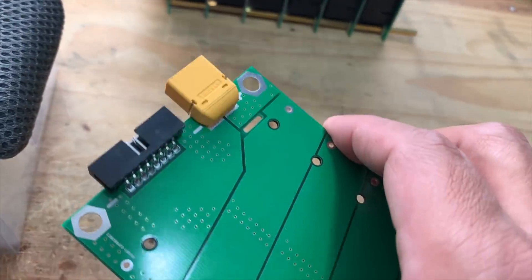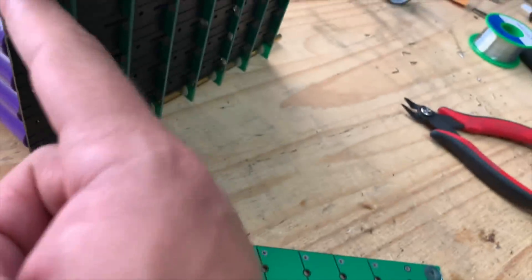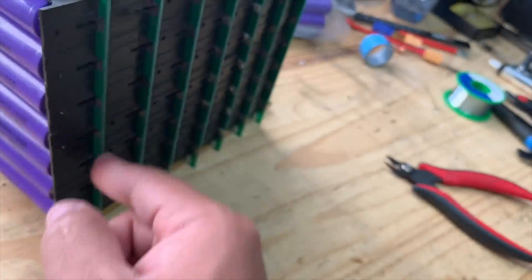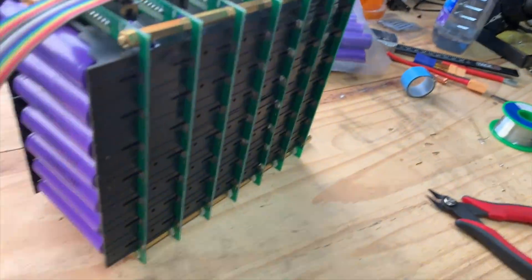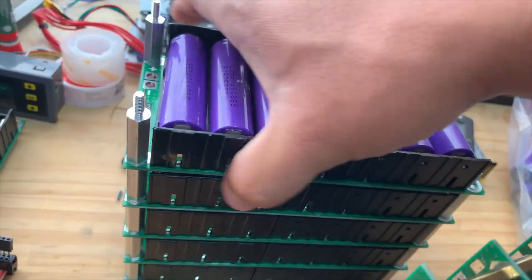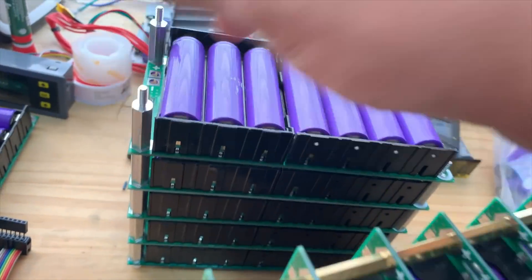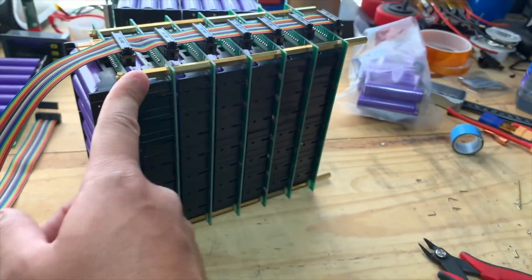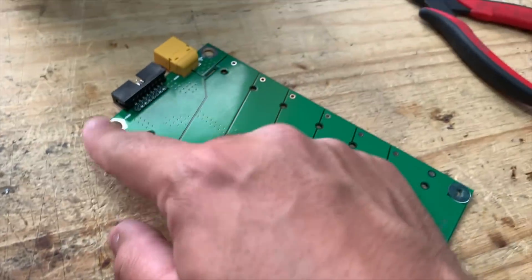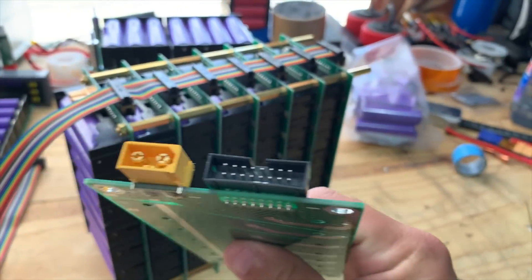Look at that — I like this, it's kind of flat. You can do that now with the boards we're doing today. This is version one, this is version two. I like the V2 because they stick past the holders, so if we ever want to do a sliding hot-swappable thing they're going to work. It'll be harder on V1 because there's nothing to go on. So there are a lot of benefits to V2, and the holes are also smaller.